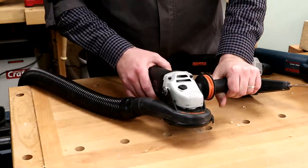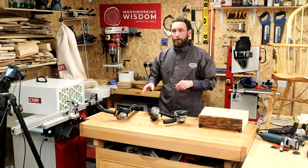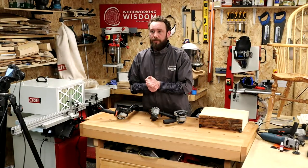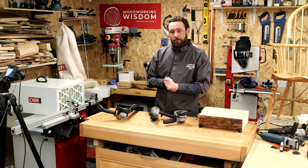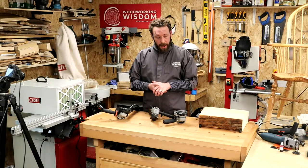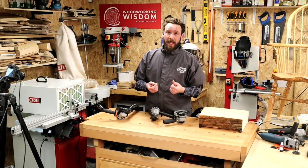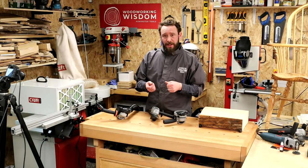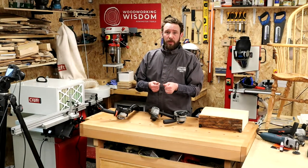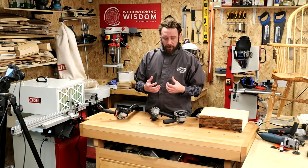Okay. We got any questions then, Steph? Yeah, so one of the questions that came in, obviously you're showing that blade there on the Arbortech grinder. One of the questions was, can you fit the Arbortech blades to any grinder? Yeah, you can. So when you buy the blades, they come with a set of bushings. And sometimes you'll need them for your grinder. Sometimes they'll fit straight on. But yes, you can fit them onto any grinder.